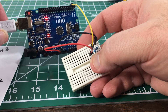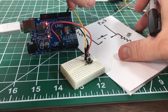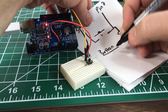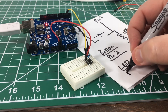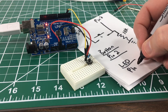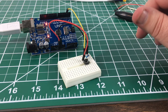Now we need to hook up our LED. Button is on pin 2, and we're going to make the LED on pin 12 — just picking a pin, that works fine. Let's go ahead and hook that up now and write it down so I don't have to look at the board when writing code.